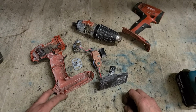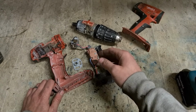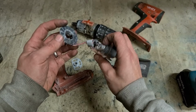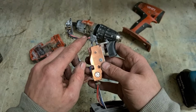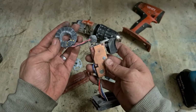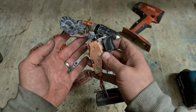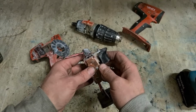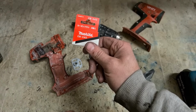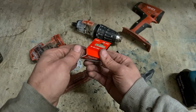Right, that's a no. I do still have healthy parts here, quite a bit of them actually, especially brushes, but I don't have this. So, no brushes for it. To order this on its own, the part might only cost 10 or 15 euro, but to get it here, it costs 30 euro in carriage. 45 euro just for a part, not really going to be worth it. So we'll do the wee Makita trick and use Makita brushes instead. At 10 euro, they're a lot cheaper.